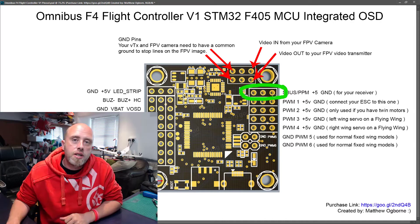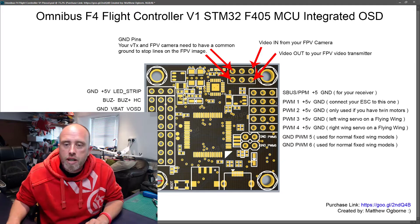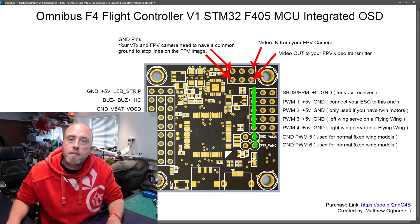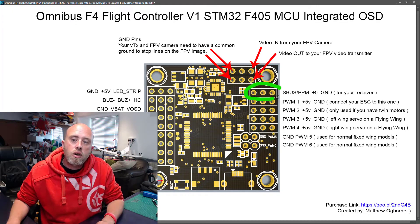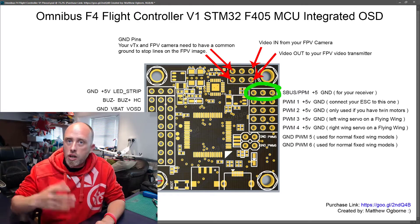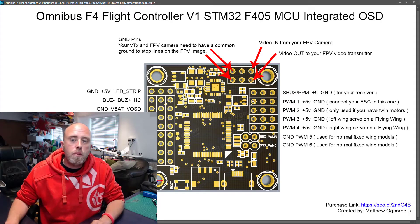On the right-hand side of the board we've got S-Bus — that's where we put our S-Bus connector in. The outside row is ground, the inner row is five volts, and then these pins here including those two little ones down there are all the signal pins. The first pin header on the right-hand side is for your S-Bus, so that's where you connect up your receiver using either S-Bus or PPM connection.